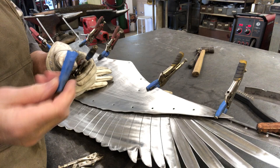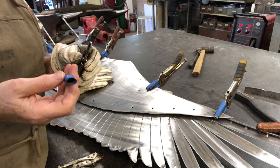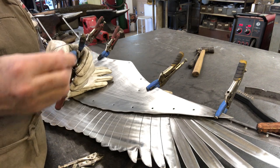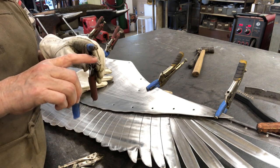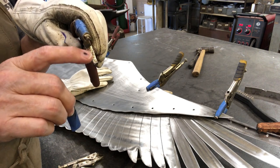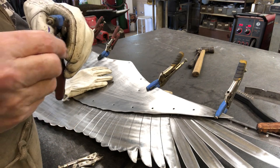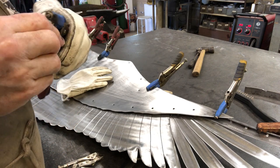These look like they're just tape, but actually there is a piece of a leather glove in here that I've cut out and wrapped around the serrated edge, because otherwise you'll end up with serrated marks on your metal and sometimes they're hard to get rid of at the end.